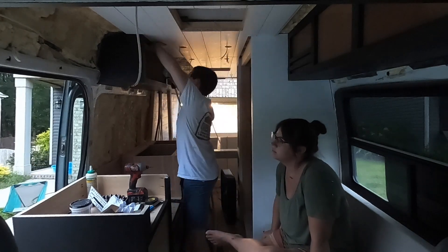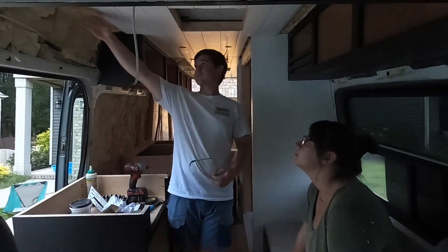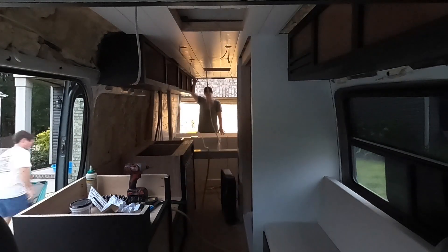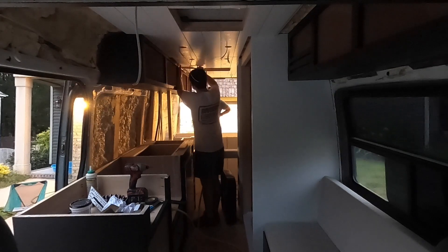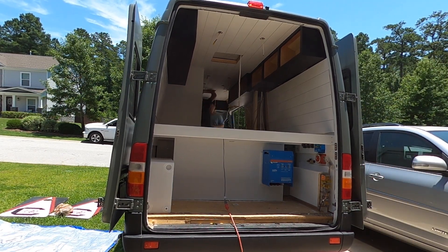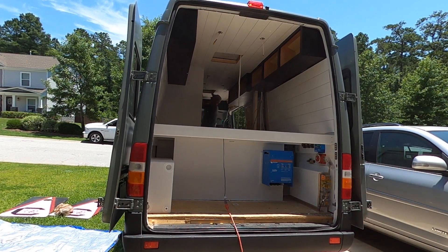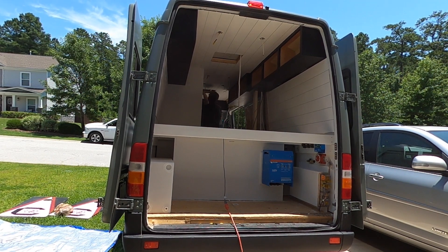One thing I didn't take into account with the cabinet design was the fact that the ceiling was going to hang over the face frame by five-eighths of an inch. You can kind of tell here but the gap at the top between the face frame opening is smaller than at the bottom. Fortunately when we put the doors on the cabinets it didn't mess them up and they open correctly, but if the ceiling had been any thicker we would have had issues. If you're going to do this, make sure you account for that in your face frame design — definitely learn from our mistakes.